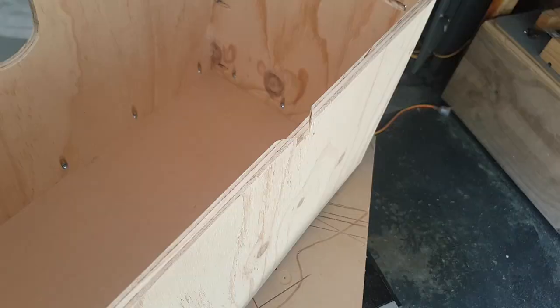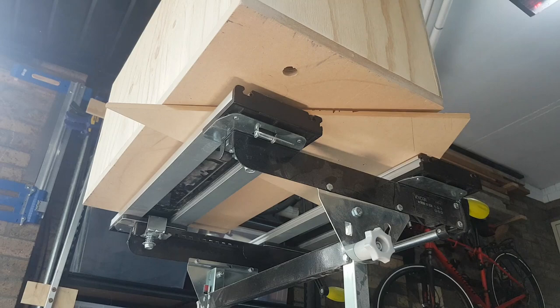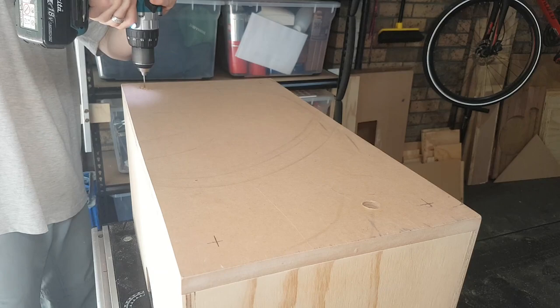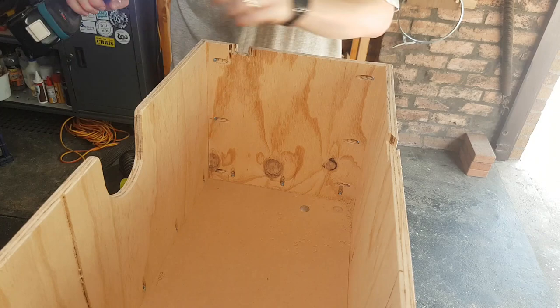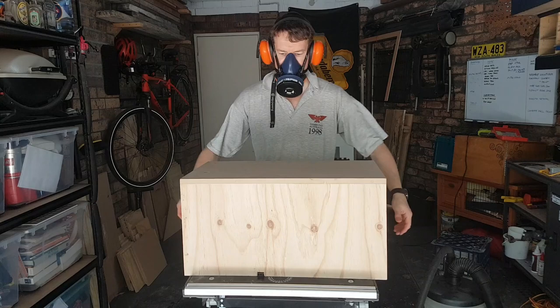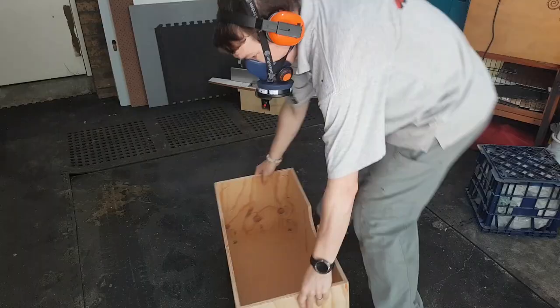This interesting little bit I actually got off Dave's Shed. When he built his vacuum cart, I noticed that little dangly chain down the bottom of the vacuum, which I had no idea what it was for. Turns out it is a static disperser — you're earthing your electrical buildup from the dust. Thanks for that tip, Dave. So I've carefully marked out and drilled a hole with the forstner bit through the bottom to accommodate the little static chain. Now to return some mobility — these are the casters I stole off the bucket, not the vacuum. The tape around the forstner bit as a depth guide wasn't such a great idea — it just clogged up the exit spouts on it — but it ended up working. I was able to countersink the nuts going inside, then used my ratcheting socket set to reinstall the casters.